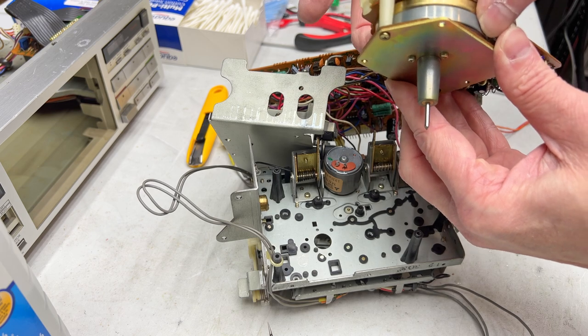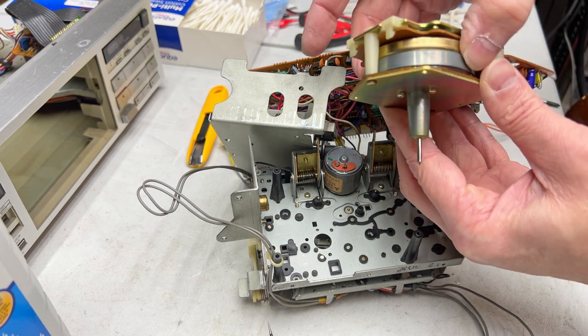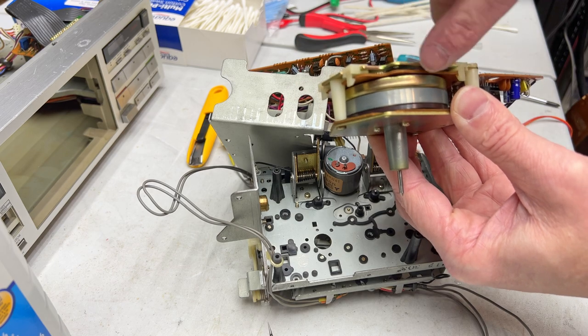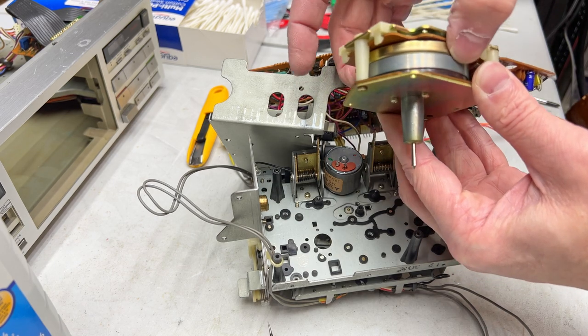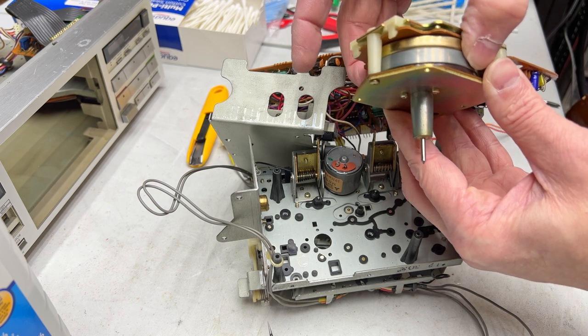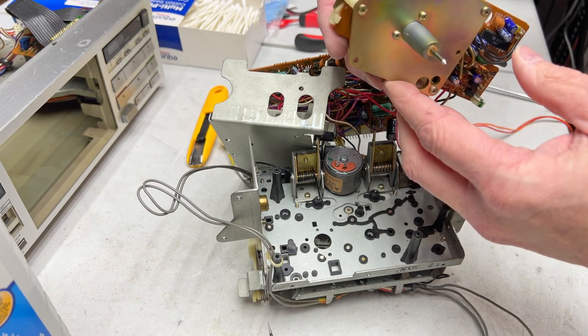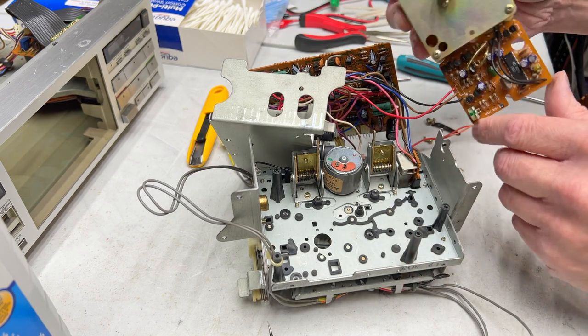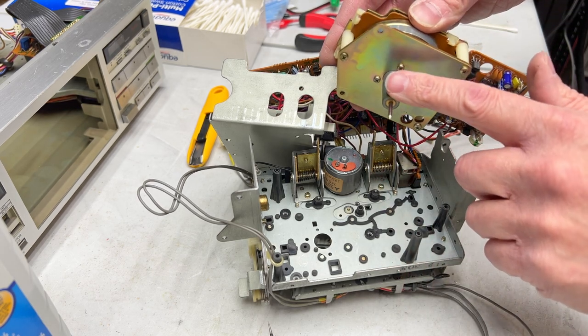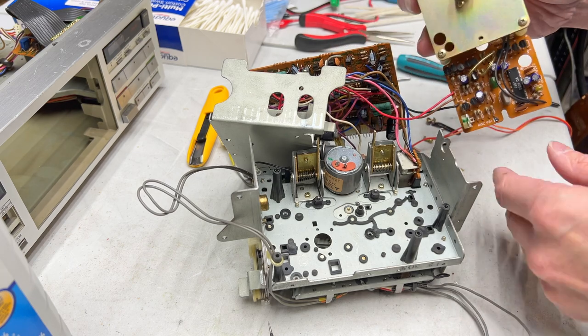The service manual has you adjusting this by feel. And it looks like it's good. I mean the distance between the thrust bearing. It's supposed to be within about a half a millimeter, I think. And that looks about right to me, so at least by my eyeballs. In order to service the capstan bushing, we're going to have to dismount this plate with the FG coil on it.